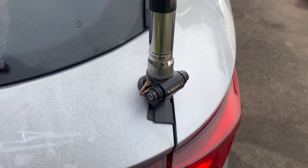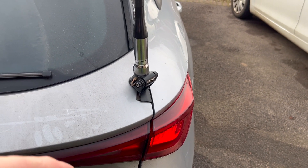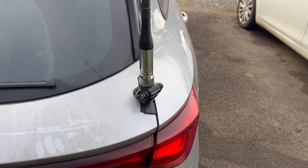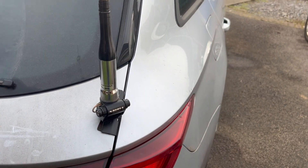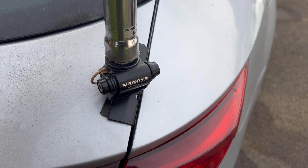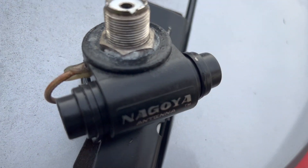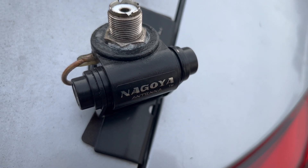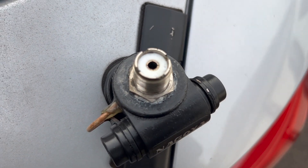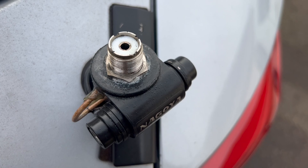One of the first things we need to do is remove the actual antenna from the mount. If we keep the antenna on the mount, because this is a DC ground, it actually represents a short to DC. So we can't do any continuity testing to see if anything is shorted, because the antenna itself is actually a short to DC - it's not a short to AC, but it is a short to DC. So we need to remove the antenna. We can then inspect to see whether or not it's wet or whether it's got any buildup. You can see it hasn't been off for a while - there's quite a good buildup of that white composite, which is the reaction between aluminium and steel. We'll clean that off. The SO239 itself looks OK, it doesn't look as if it's got any water or moisture in it or if it's worn or gapped, but we'll clean all that up anyway.